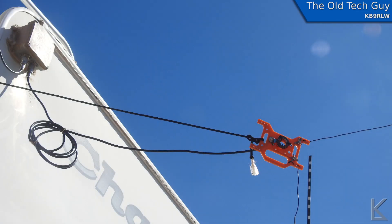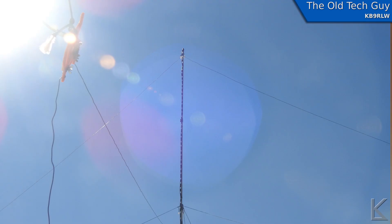So let's go look at a couple of demos. I'm going to compare it to another antenna — I have my Elk Pack end-fed half-wave for 40 meters up as well. That's a real common design, it uses the 49-to-1 that Steve Ellington popularized at the end. It's a regular old end-fed half-wave antenna, like a lot of people are using. And it's noisy compared to the doublet — its noise pickup is probably what you're used to seeing on a lot of antennas. But I think you'll agree when you see the difference between the two, that the doublet is a lot quieter.